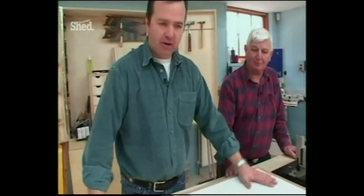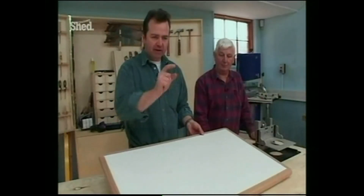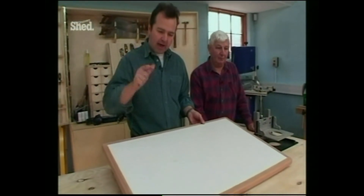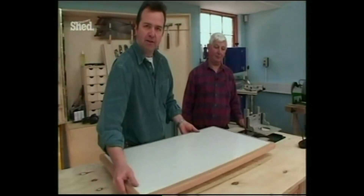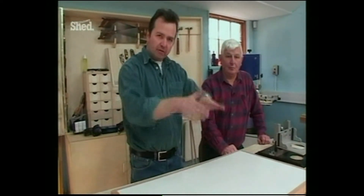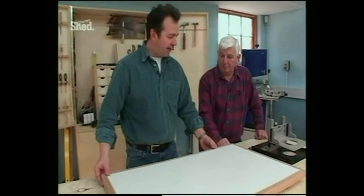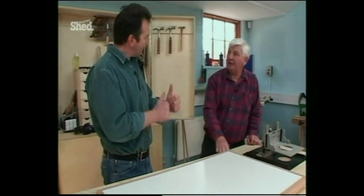I just want to talk about the top that we've made here. It's 18mm ply, birch face ply — the same material I've used for the base — and I've laminated it with formica on both sides. If you're laminating anything, you must do both sides to balance it out, because although formica is really thin, it will make it sag. Just the sheer weight of that will make the top sag. I've also trimmed it out with a piece of hardwood I had kicking around the shop.